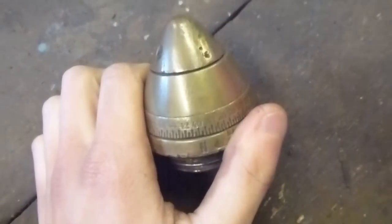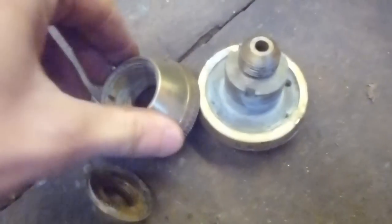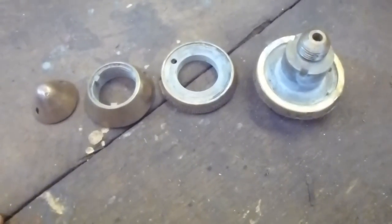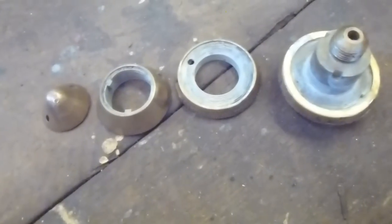It's actually designed to clean bricks and concrete, but it works just as well on brass. The idea is you get this tub of brick acid, put some into a spare tub, then take the fuse apart into its components and soak it in there for about 20 minutes. Don't leave it in for a day or two like they say on internet forums — don't do that, it's not going to do it any good, it's going to mess the fuse up. If you use brick acid, 20 minutes maximum.